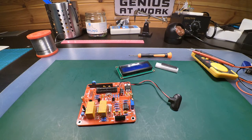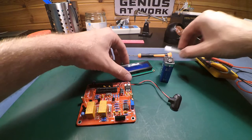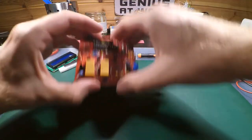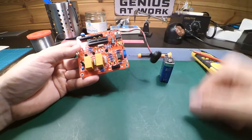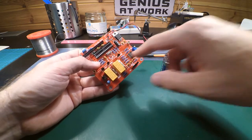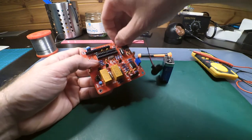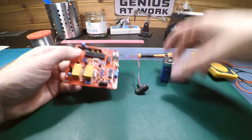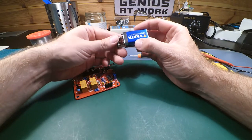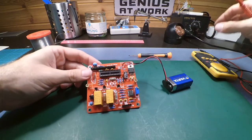We're going to do a power-up test. For that we need a 9V battery and no ATmega installed, no display installed. The rest is in place with the sockets and everything. The op-amp on the input is even a Texas Instruments op-amp — so some quality components. 9V battery, correct orientation, plug it in and no smoke.